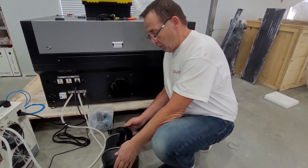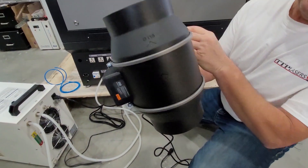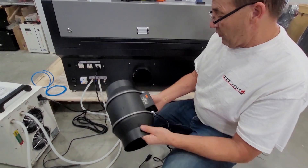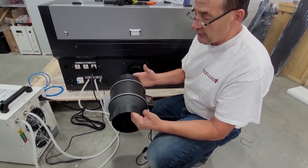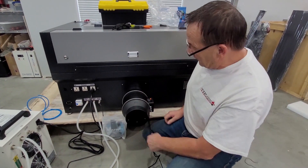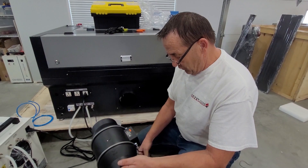What's important to know with these exhaust fans is that it has an arrow on it that will show you the direction of the wind flow. You want this pointing away from your laser machine. There are many different ways of setting these up — for example, we put ours in the attic, some people put them in walls, some people just put them right in the back of the machine like this. You'll have to figure out whatever works best for your situation.